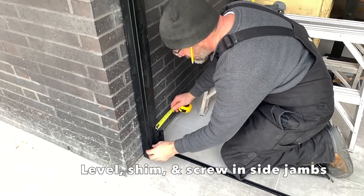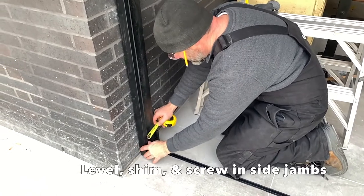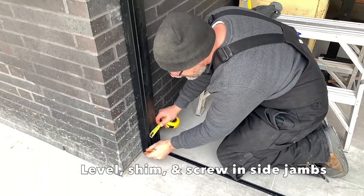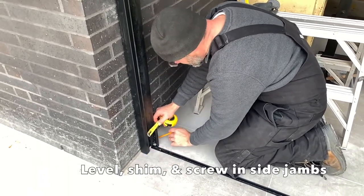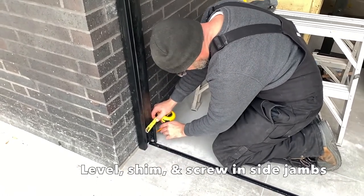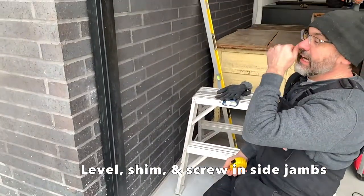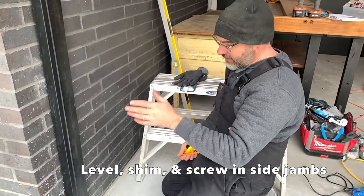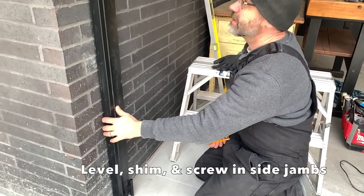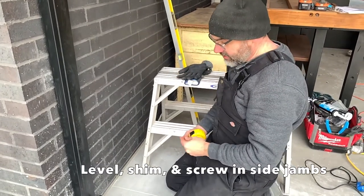So we're going to move the door frame until we get to that 2 1/8. And we'll put a mark here. Mark on the inside or on the floor, whatever's easier. We'll check that with a level. If that lines up the way it should, we're good. We can start to fasten, shim in behind the frame and install it. If we do need to, we can always move the header a little bit back and forth, in and out, to make sure that they line up.